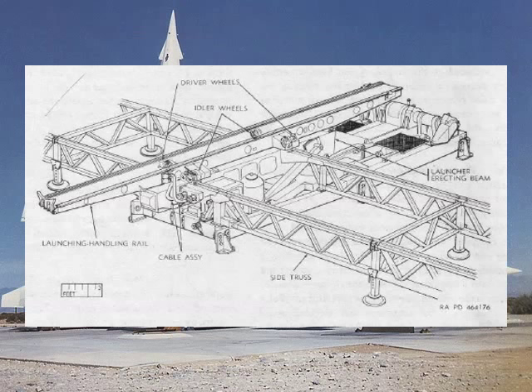Here's a different view of the same thing. You can see how the rails line up on it. Here in about the center of the picture you can see two big plugs where the cable assembly is pointed. Those plugs are each about eight inches in diameter, with maybe 25 or 30 pins each, and they're hooked together in this big manual thing that holds them both together. As a crewman and an operator, in order to become solidified in the MOS, this was the most difficult thing to do — you had to be strong enough to hold it in there, slide it in, and lock it down in 10 seconds. Now, 18-year-old me only weighed 106 pounds. I damn near failed.